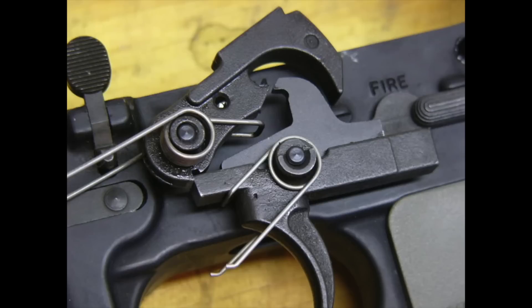What we're looking at here is a traditional AR-15 fire control group — this one is semi-automatic, however the military version is virtually identical. There are not too many components: some springs that apply pressure to the hammer and trigger reset, a spring impinging upon the disconnector retained within the trigger assembly, and a couple pins that slide through the lower receiver to retain all parts. This provides usually an eight to nine pound trigger pull, which for a military design is totally acceptable, but by modern standards isn't necessarily considered optimal.